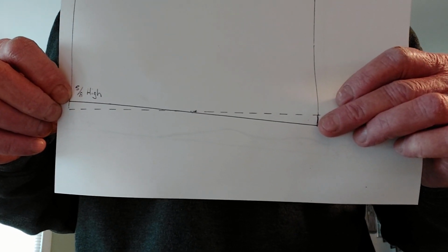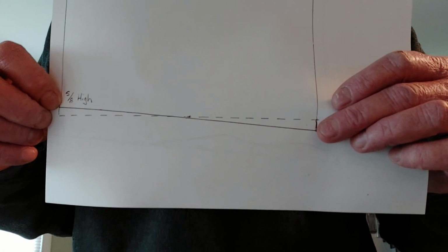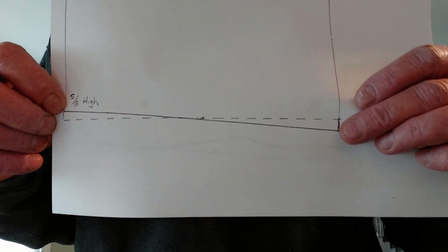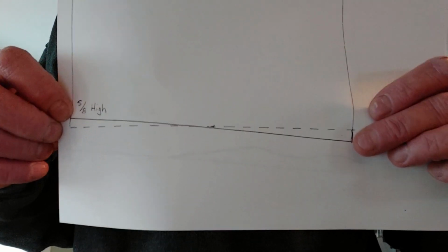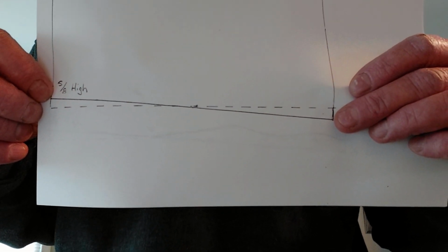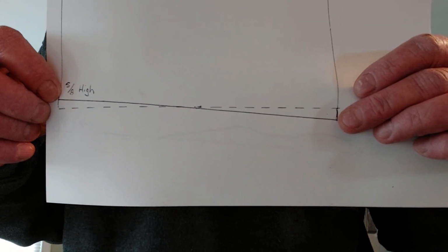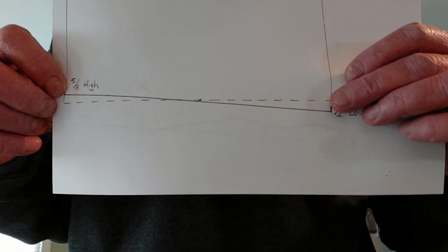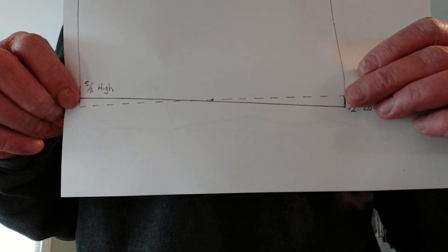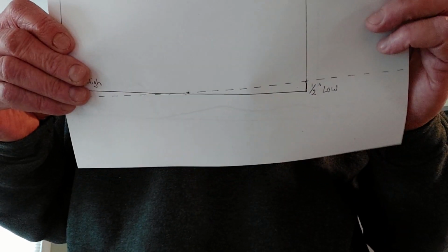So the problem with this started with the foundation, and they did not correct it. Maybe they found the problem with the foundation. I hope they used a level when they put this thing on. They had to have known that the foundation was not level. And I guess they just said, screw it, let's build on top of this unlevel foundation, and we will fix the floor with underlayment once we're done. But there is no fixing this floor. To make it level with underlayment, like I say, we can make it flat.